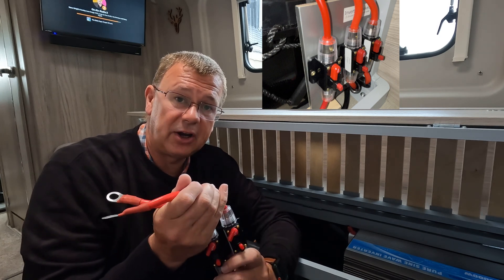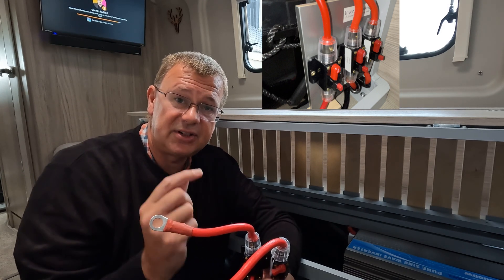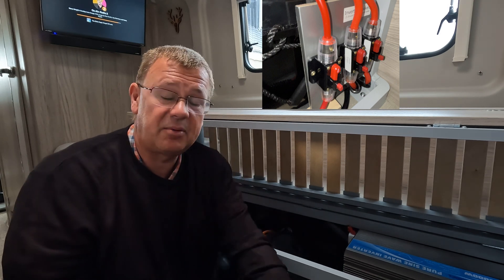However, I found that both the breakers and the cabling were actually warming up. When cabling increases in temperature it increases in resistance, and when the resistance increases it heats up more quickly, which wasn't helping the situation. I noticed this when cooking microwave meals — short things like a burger, no problem, but when cooking a full meal that took 10–15 minutes, about seven or eight minutes in the microwave reset itself. I investigated further and realised the cabling was running a little bit warm, creating a thermal runaway situation.